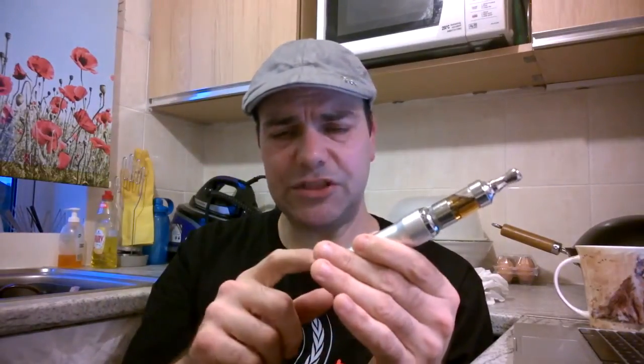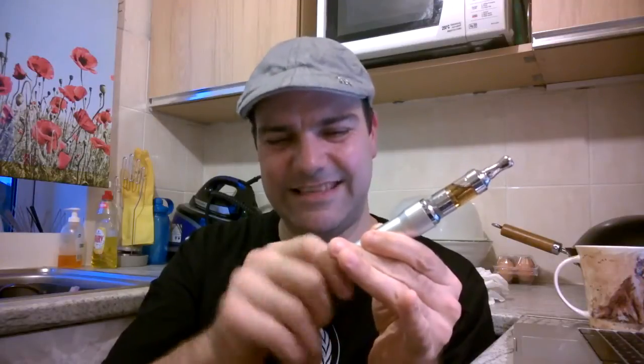Like I said, I did have an issue with the locking ring on mine, because when I was actually undoing it, it would get about halfway down and start to get really stiff, to get it to the point where it will safely stop the button from locking. When it comes down, it is lock solid. However, I had to strip mine apart, clean out the metal swarf, put a drop of oil in there, and it's now as good as gold. But as far as I'm aware, I'm the only person who's actually had that. So just luck, I suppose.